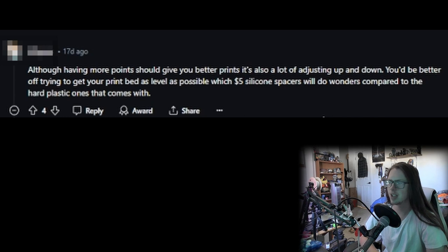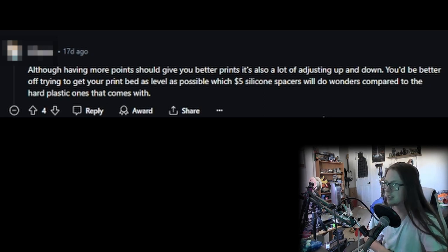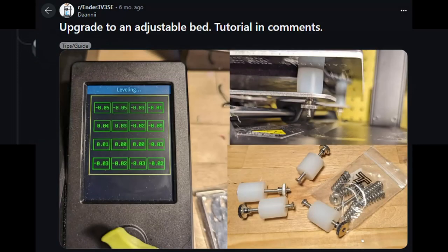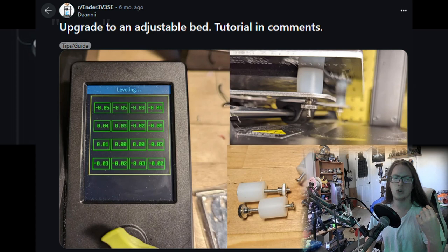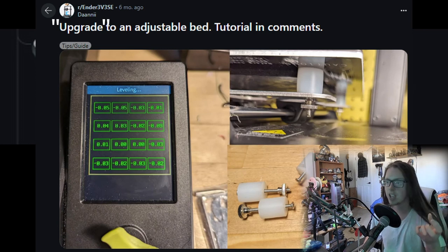This person says to just get the rubber silicone flexible standoffs instead of the normal standoffs, because Creality badly messed that up. Even though they tried to compensate for the weird shifts in their bottom plate, they did not do so remotely correctly. Then another person replies with a tutorial going even further — they got new longer screws and put knobs on the bottom, essentially converting it to the old form of bed leveling combined with auto mesh leveling. So that's why I keep saying it's effectively an Ender 3 V2 upgraded with a BL Touch, but with less community support for now.